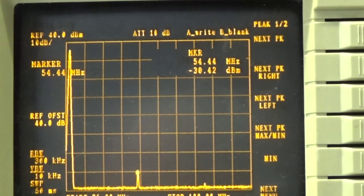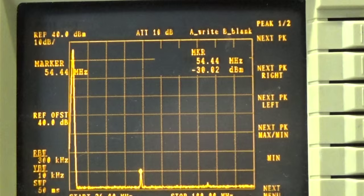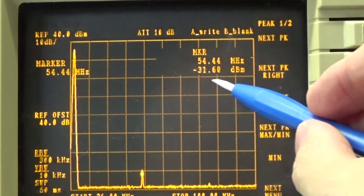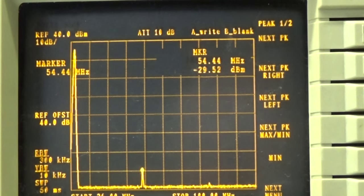So this CRT radio produces exactly the same harmonics like the Cobras, and that is something, to be honest, I do not really understand, because I've shown you the German paper, what is required to operate the radio here in Germany, and in the regulations it is clearly said that harmonics, and spurious of course as well, must be below minus 36 dBm, and that means this level here is too high. It needs to be 6 dB lower.